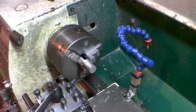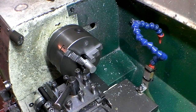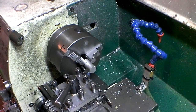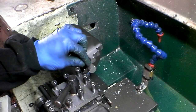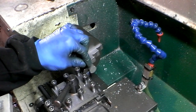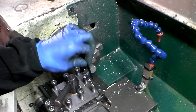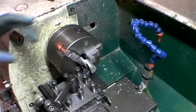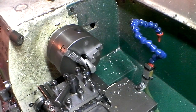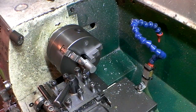I just realized that my X is not zeroed — it currently says negative 15 inches. So for this part, outside tolerance is unimportant; I just want to scrape the ugly off. I'm going to go in until my 2-thou shim hits. Right about there — now it's stuck. So 0.75 diameter plus 2 thou on each side is 0.754. Zero that, and now we can start cutting.